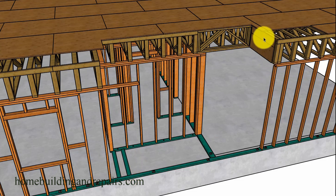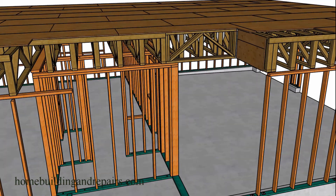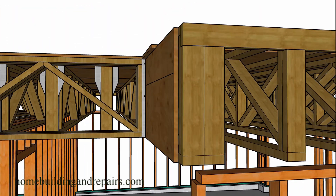We are going to be using a plywood ledger with a line. The line is going to represent the top of the stair stringers where they connect. We're using a three-quarter inch piece of plywood — you can always use a two-by-ten or two-by-twelve here. This piece represents our riser, so you'll need to compensate for that when laying out your stair stringers.